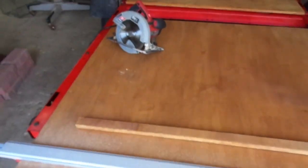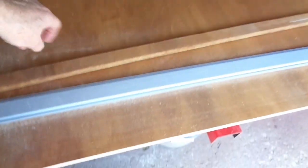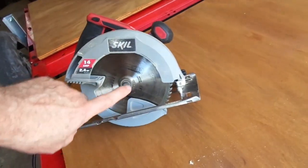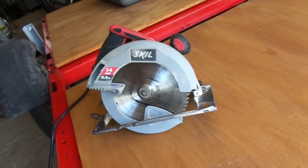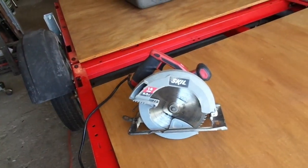I clamped it on there, measured it off, and if you look at the edge I produced here, it's really nice — even better than the edge the guy did at Home Depot, partly because I also have a better saw blade. That's a 62-tooth saw blade, which is expensive. Always put your money into the saw blade. Get a medium quality saw with a really expensive saw blade, or if you can afford both get them both, but if you have to choose, put the money in good saw blades.